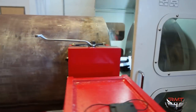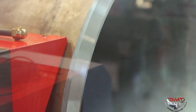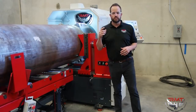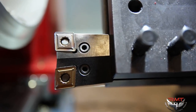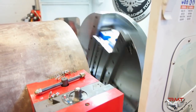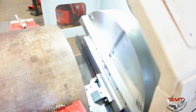You can bevel in extremely fast time. For example, again, 30 inch pipe, one and a half inch wall — complex bevel in 15 minutes — all done with one tool which has dual heads on it. It can handle everything that you need to do. You can also hard tool when you need to if you have a set profile that you want to maintain or are doing constantly, which can also speed up the process dramatically.